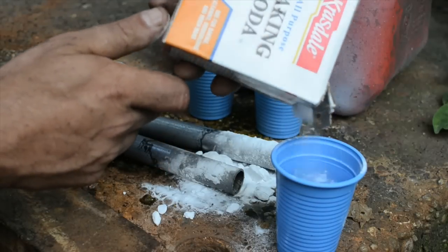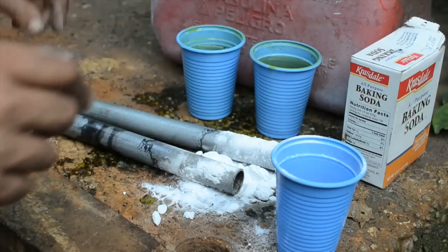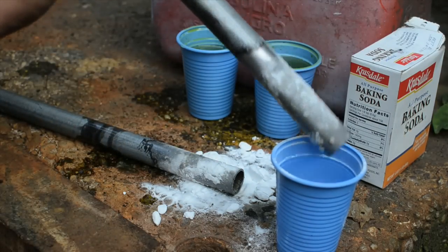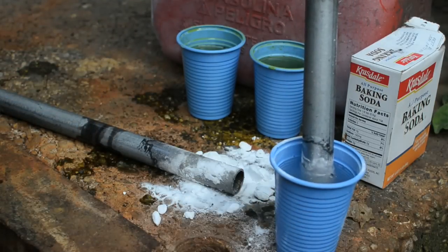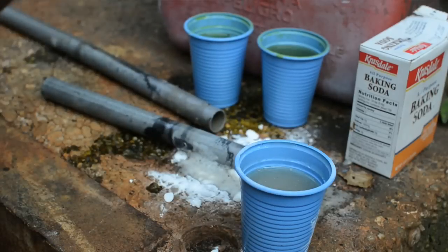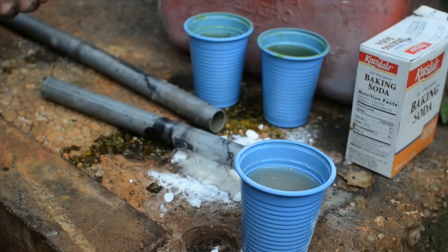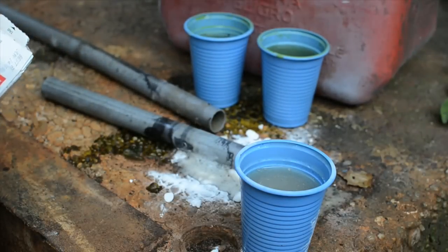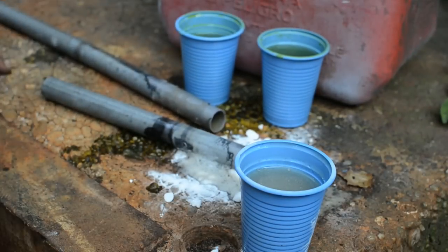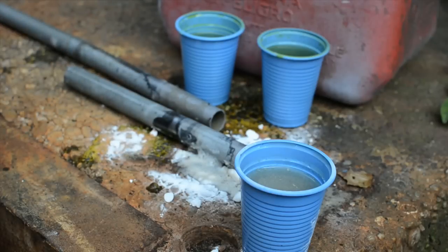I used the acid to get the galvanization off the inside as well as the outside of the pipe. Now I need to get the acid off the inside of the pipe, so I'm making a solution of water and baking soda and dipping that in. Muriatic acid is commonly used for cleaning cement. If you dilute it with water — especially if you neutralize it — you can dump it down a drain. You're no longer dumping an acid down, you're dumping a salt and water. If you were to spill this on your workspace floor or on your assistant and you wanted to neutralize it, you just dump some baking soda on it. Oh no — a spill of acid. Baking soda will fix it. Ta-da! Science!